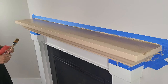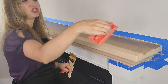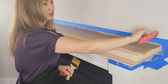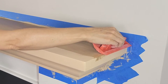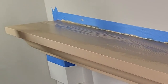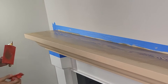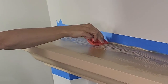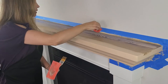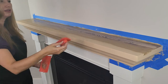I'm going to start with the large graining tool and keep my brush with me so I can wipe off excess. I'm going to take this edge, angle it down, and just pull it through — maybe rocking it once or twice with my thumb in when I rock it. That's awesome. Now I'm going to wipe it off and take the smaller one to get in where it didn't reach. There are a few places here — perfect.